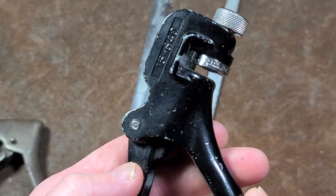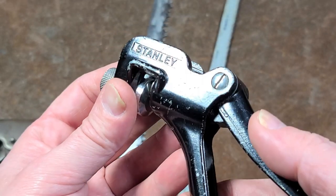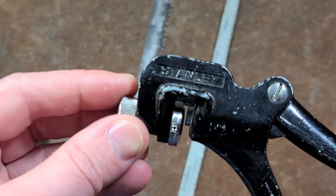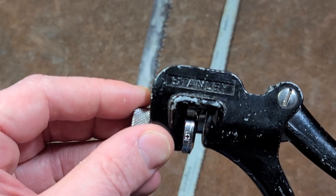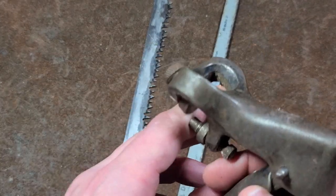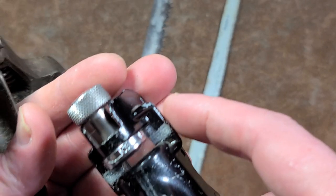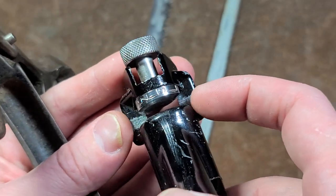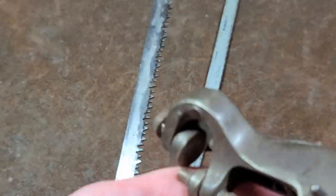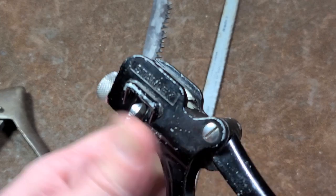That's my review of the Stanley 15640, which I'd call a professional-level manual saw tooth set. Definitely pretty cool. I like how it works with that plunger that actually grabs the blade — it makes it simpler to use than the older style where you need to maintain good tension yourself. I just wish Stanley had put some steel inserts in the cast aluminum body, as you can see it is getting some wear, though even steel ones get wear too. Kind of a tool from a bygone era, but it surprisingly still has some use.